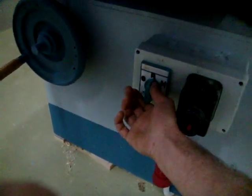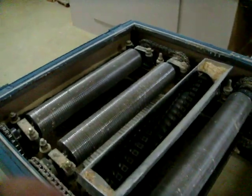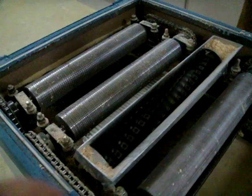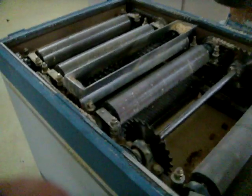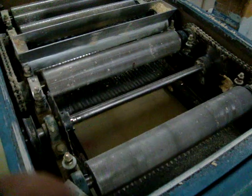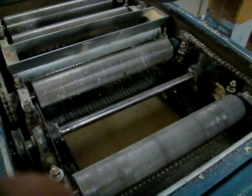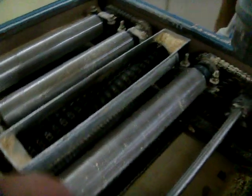I can choose to turn the planer on or the saw on — both use the rollers. It's just a matter of adjusting the table a little bit lower so the cutter head doesn't catch the board while the saw is cutting it. Or I can use both at the same time — plane the board and rip it down. I mainly use this for ripping boards in two equal pieces for gluing before I put them in the dryer, so I don't have to worry about splits.